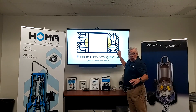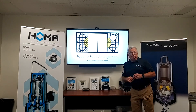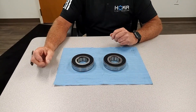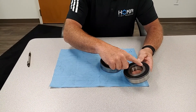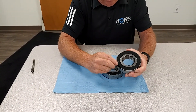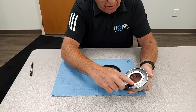You can see it on the drawing, but now we're going to look at a couple of bearings I have on the table so you can actually see those bearing races. Here we have two bearings we're going to be installing on the pump. Remember, a bearing has a larger face on the race and a smaller one on the back side — and the same with the outer race: you have a wider face and a thinner face.